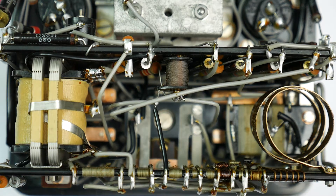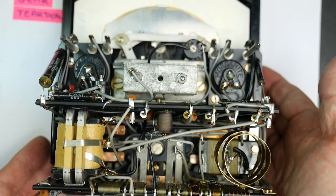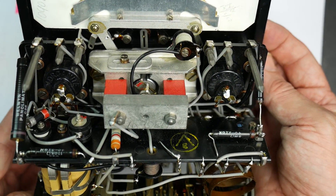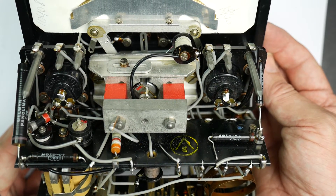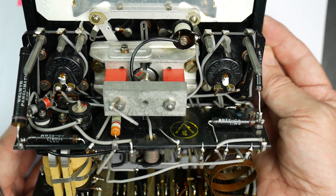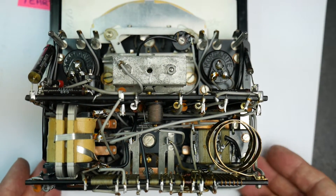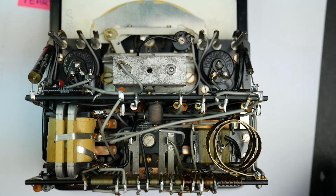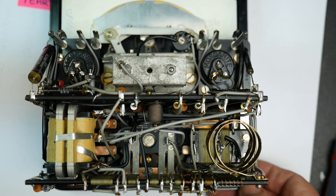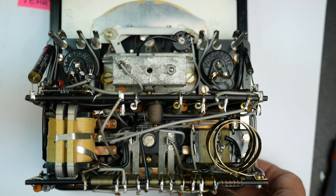I think that's pretty much it for the very fine AVO Model 8. It's all Bakelite, all brass and copper inside, with big hefty components and big magnets. They don't make them like they used to — look at all that hand wiring. This would have been manufactured on a production line by hand, just soldering wires on. Later versions, including later marks, had printed circuit boards — they look the same on the outside. You can tell from certain characteristics which mark they are, but they're generally the same size, same controls, same ranges, so you could train someone on one and then buy a newer mark and it would all be just the same. That's the AVO Model 8 Mark II Analog Multimeter.